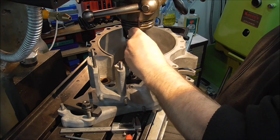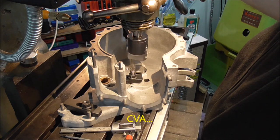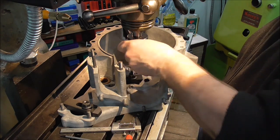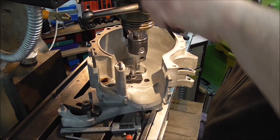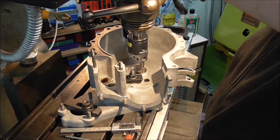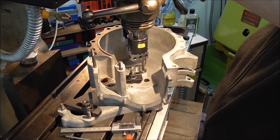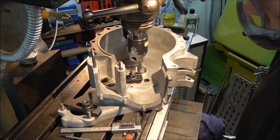It's a very short table, but it's also got a head that you can tilt on a handle in the same way as you can move the tables — you can actually do dishes if you want to. But I've got the head trammed in nicely so I don't like moving it unless I absolutely have to. If I have to do anything at angles I've got a biggish angle plate that I use. So that's all I'm doing with this — just keep putting a little bit more cut on and bring it around. We'll come back when I've got the groove done.